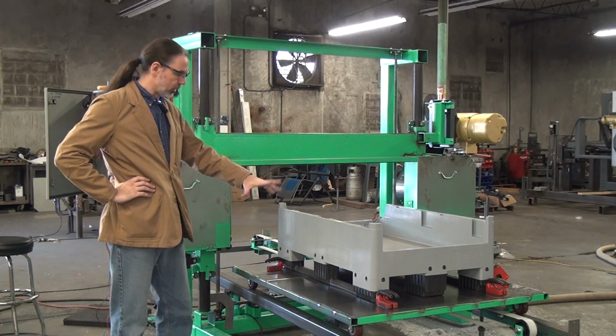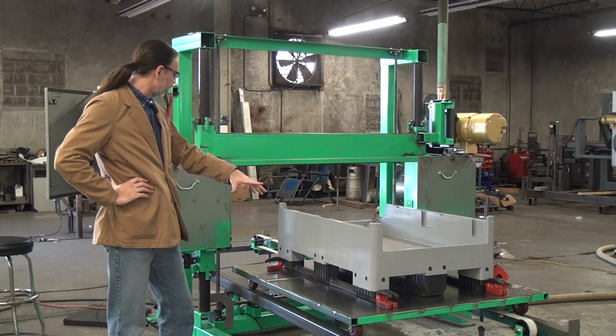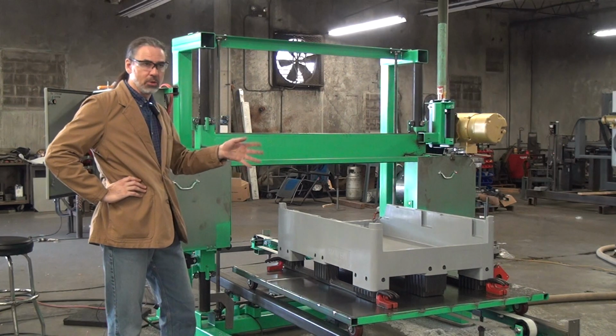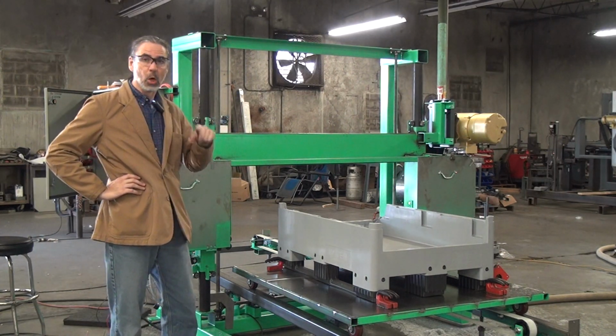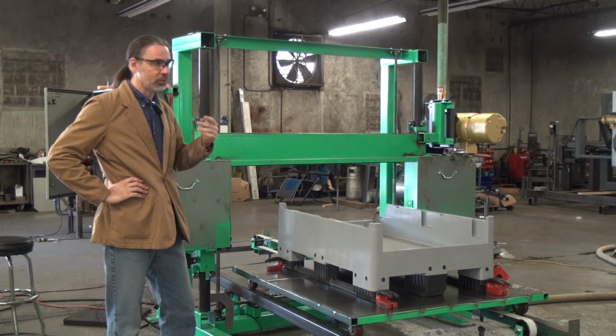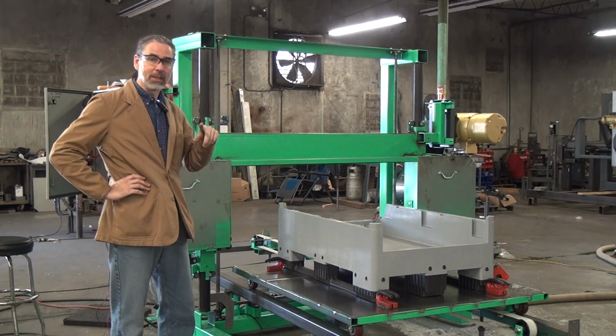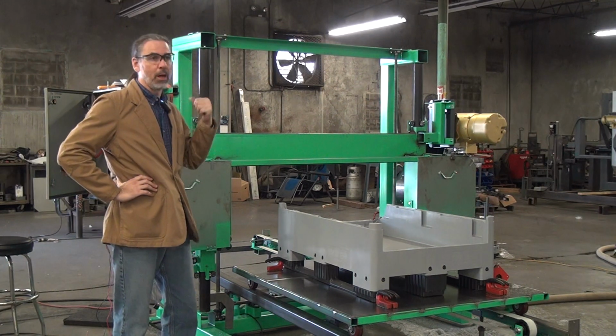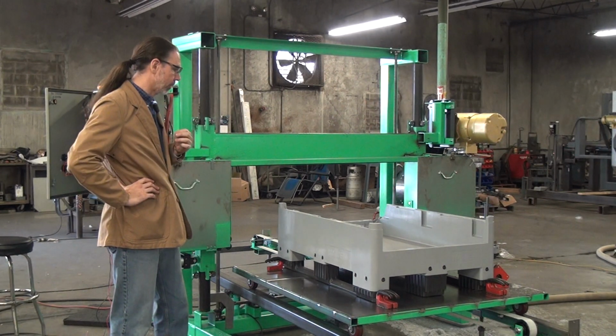Traveling table, it's a steel traveling table. Powered, variable speed, speed range standard 0 to 2 inch per second. You do have the ability to overspeed that though. You can run it probably as much as twice that fast, but please ask me before you try to make any changes to do that to one of my machines. It's in the control panel, you just want to make sure what you're doing there.